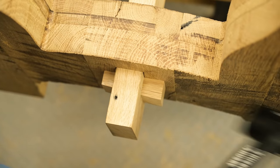Finally, I'm going to spray finish using my gold standard Total Boat Halcyon. This is the amber, which is gloss, and then I'll come back and top coat with clear satin. Oh shoot, I've also got to domino the attachment points afterwards. I always forget to do that before I finish. But yeah, almost done. So glamour shot kind of thing now, because this is fun.